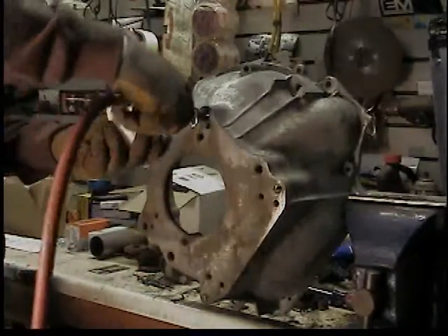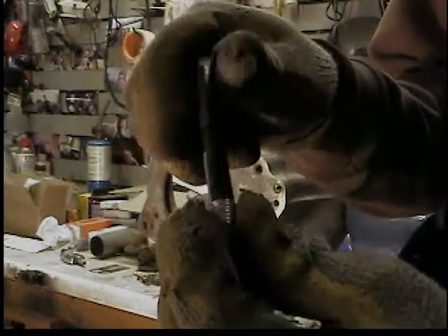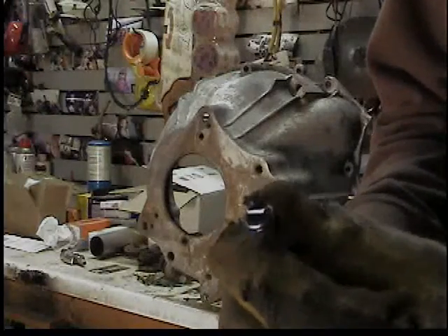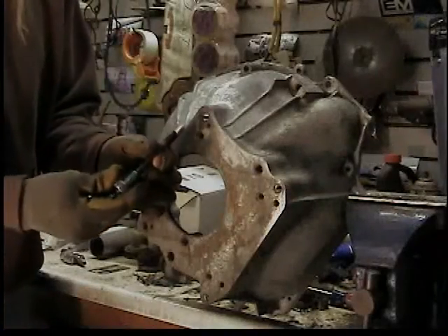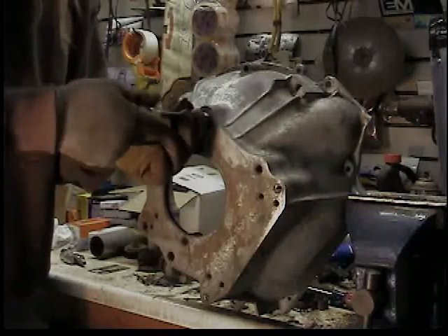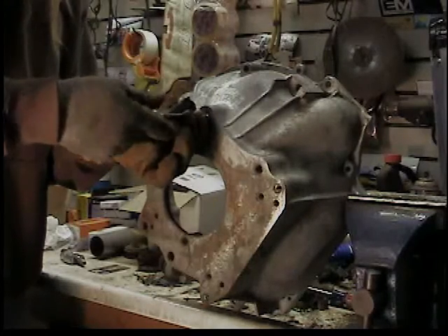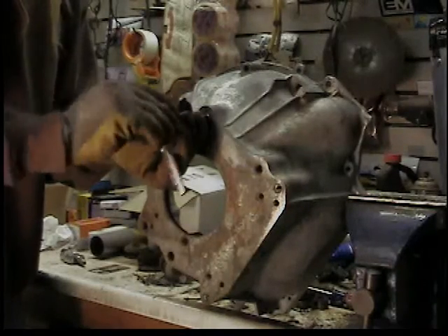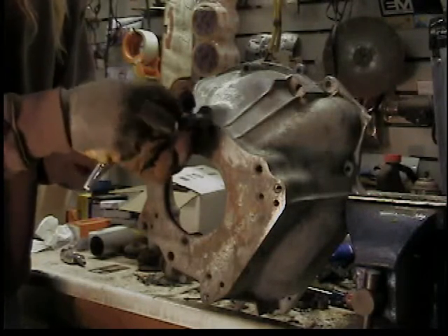These inserts come in the kit and you can buy additional inserts when you run out. They thread onto an insertion tool they give you — all the way in until it butts up against the tang. There's a tang that runs across the center, and there's a tang in that insertion tool that'll catch it and allow you to screw it into the freshly tapped hole. Run it all the way in — you want it to finish about a quarter to half turn inside your tapped hole. You don't want it sticking out at all.